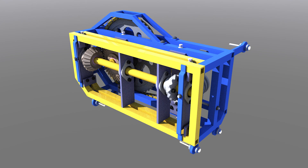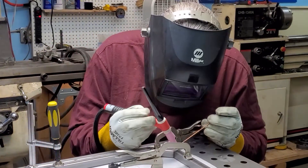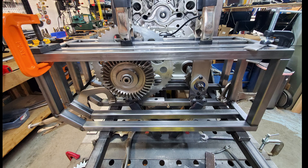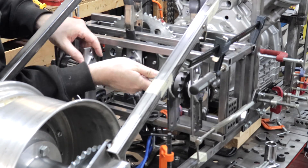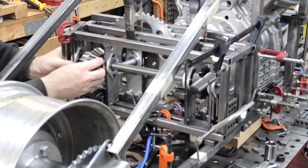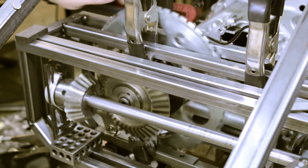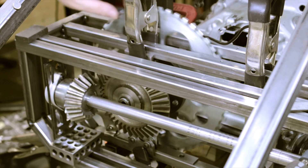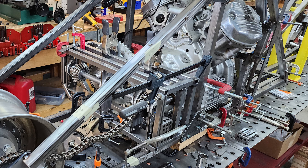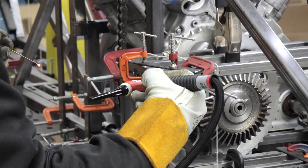With that I can move on to finishing the framing of the engine redux cage to get ready to mount the output shaft. I jigged up two more layers of the engine redux cage frame and individually tack welded each layer together and then fit tested the whole thing in the bike. That was looking pretty good so I went ahead and did a quick fit test with the output shaft as well, but without the large bevel gear. I was happy with that so I tried it again with the bevel gear. I was quite satisfied with that and thought it was good enough to move forward. I added a bunch more clamps and plates and 1-2-3 blocks to prep for welding and then went ahead and tack welded these two additional layers in.